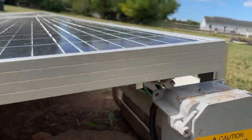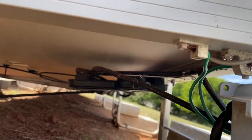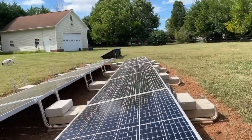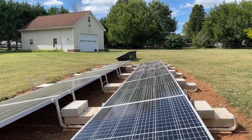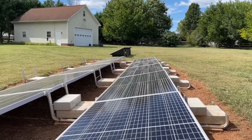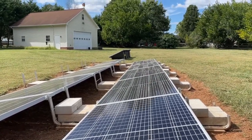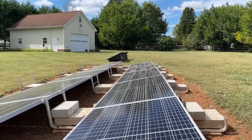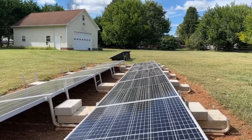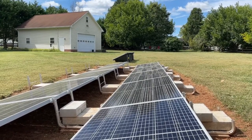You can see under here all of these panels are grounded by a ground wire that goes to all 10 panels. On the new ones, the Hoymiles inverters have the ground wire installed in the cable. I use serrated head flange nuts and bolts to mount the inverters, so I have a good ground connection between the frame of the panel and the inverter — that converter cable covers the grounding for me.